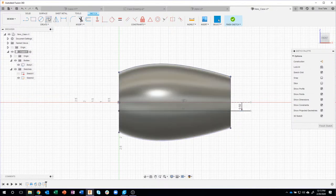And I'm going to use that when I create my 3-point spline right here. And I'm going to go ahead and snap to this edge. And you'll notice when I get near that edge, it turns from a plus to a cross, like a little X. And that means it's going to create a coincident constraint automatically on that edge. I'll say okay, and there's my 3-point spline.